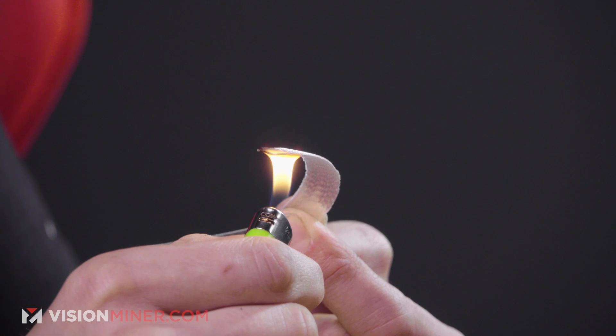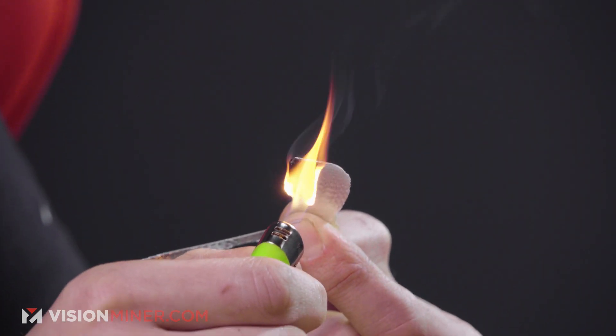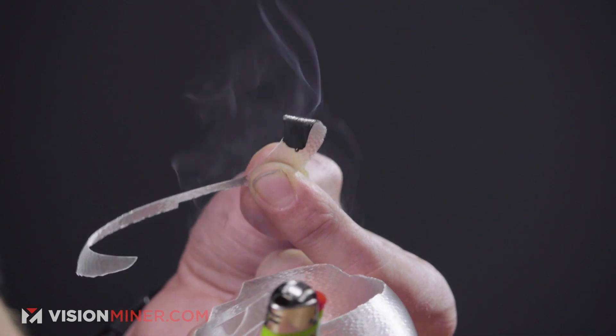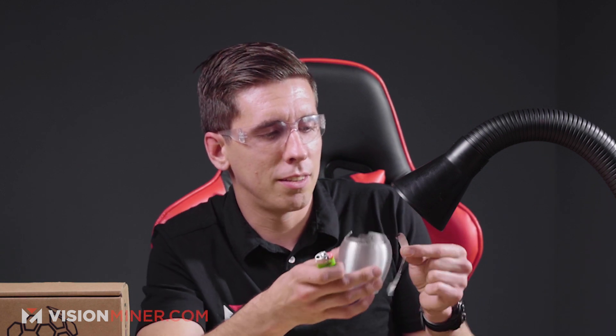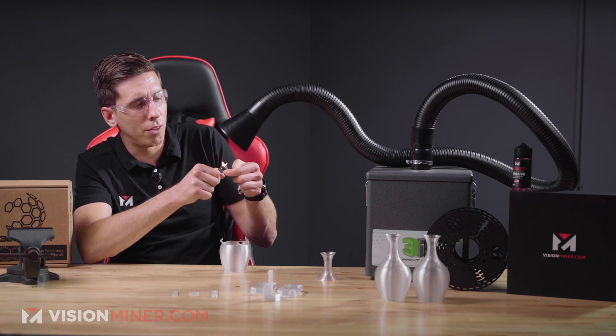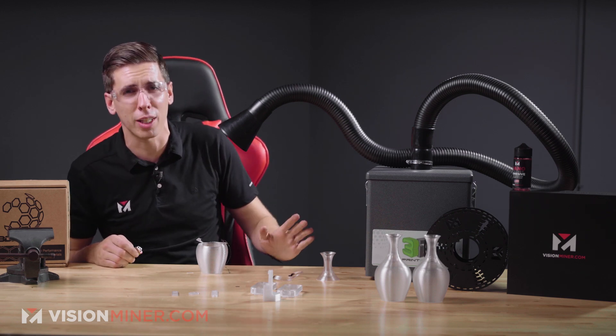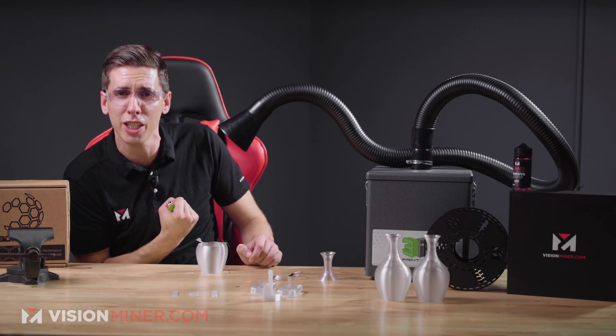Counting to about 8 seconds — yep, that's going. Is it going to put itself out? It went out down there, probably ran out of oxygen. Interesting. Let's do the other side and see if we can get it to go out — that's going to drip. So make sure when you're doing this at home — actually, don't try this at home; I'm a professional with hands of steel. This stuff burns and drips — very important to note. It's not flame retardant like a lot of the other materials we have like PPSU or PSU that have UL 94 V-zero FST ratings. This will very much light on fire and drip on you.